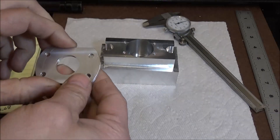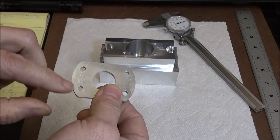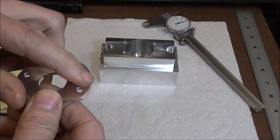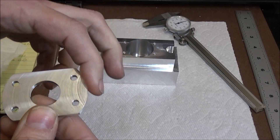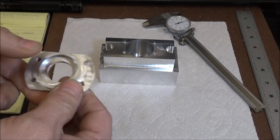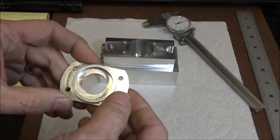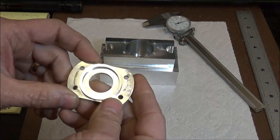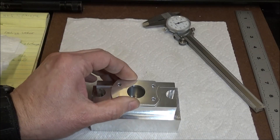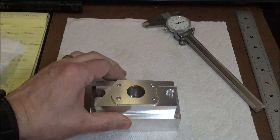Some fine tuning to the G-code — there's always something I tend to forget. I could have added a small chamfer on the outside of this. Also on my facing operation, it started to lift up before it got clear of the part, so it needs to go over about another half inch before it starts to lift up. It did the same thing on the bottom, but you can't see that because it was all cleaned off. See, it fits in like so — that will keep the bearings in there and keep everything held together.